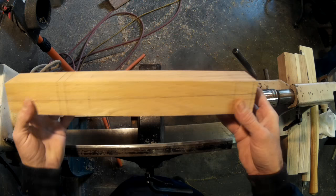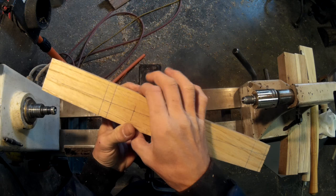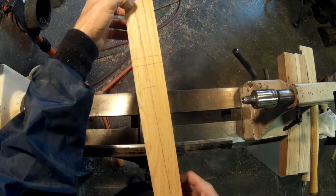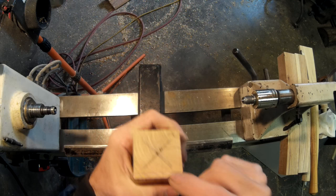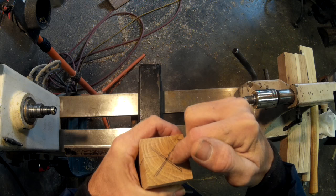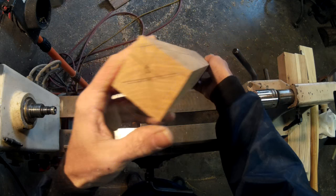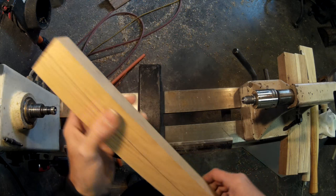At the other end, you carry that line up and across through the center of where you want it to meet the round of the initial axis. Okay? So carry it through there, up to there, and up to the top. And since this is going to be the foot pointing towards the corner, I had to do that on two sides. And then cross those two lines, and they cross on the opposite direction on the other end. But since this is a 16-inch piece, we're a little over a third down the thing, so it's a little bit different distance than it is down here. And this one I had to move in a little bit too when I changed it. But anyway, you get the idea.